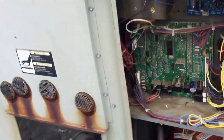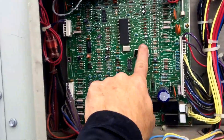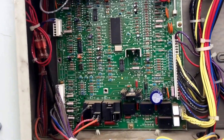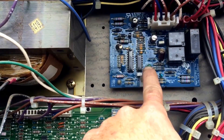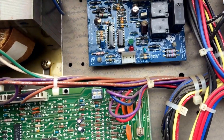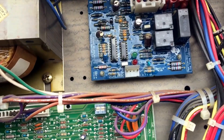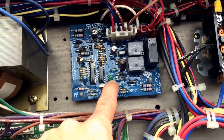I'm going to shut this off because what I really want to focus on today is this is an old-style Voyager with the UCP module, the big circuit board in it. This is the ignition board on a Trane. It's got a green LED down here. When the LED is beating on and off like a heartbeat, you have a steady call for heat. If there's a code, it'll flash here and tell you what the code is.